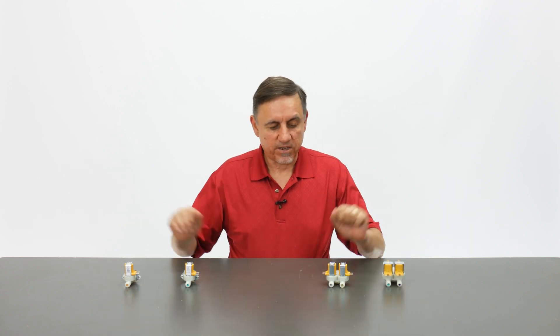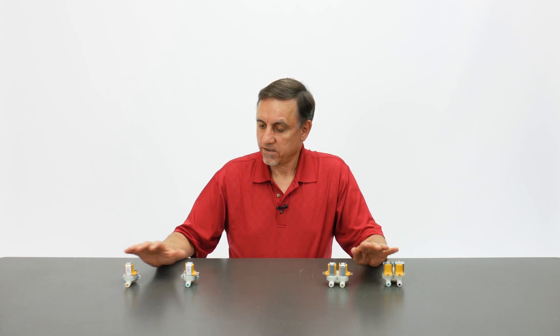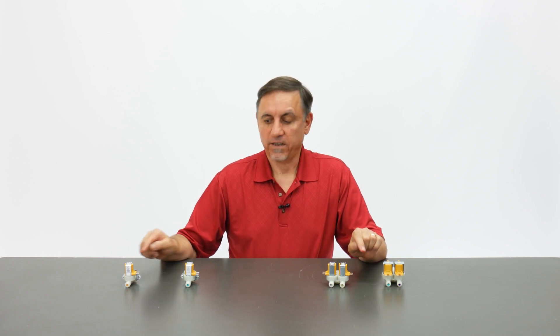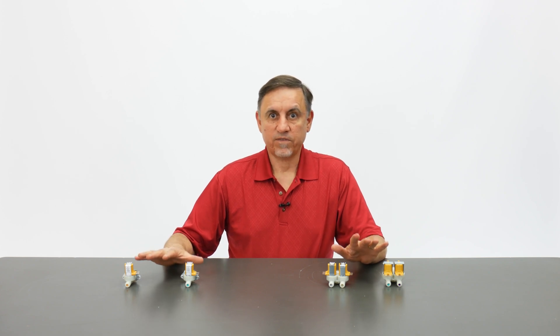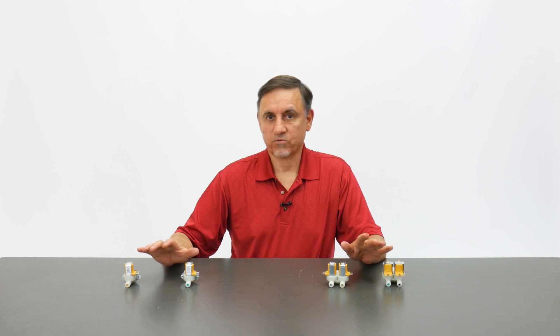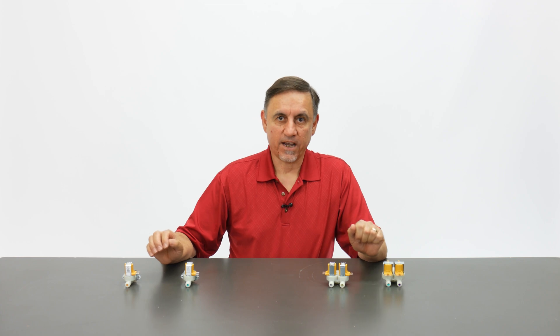The purpose of the different colored orifices is gallons per minute flow rate. The computer within the humidifier knows how long it takes to fill the tank based on the orifice size in the fill valve. Because it knows how long it's supposed to take, if it's taking extraordinarily long — fill valve stuck closed, drain valve stuck open, water turned off — it knows there's a problem and is able to kick out an error code.